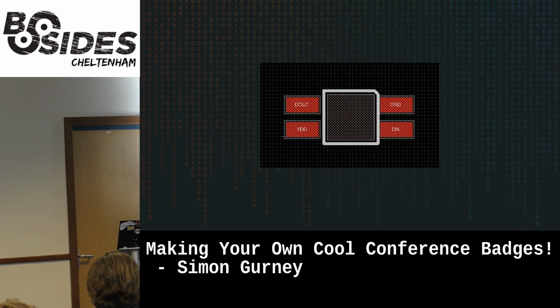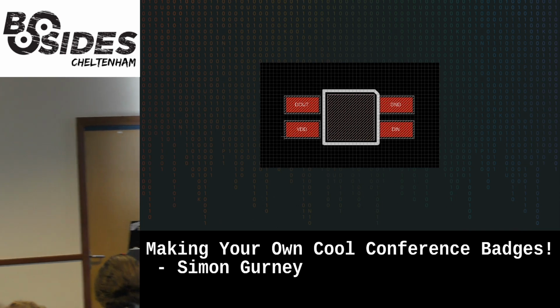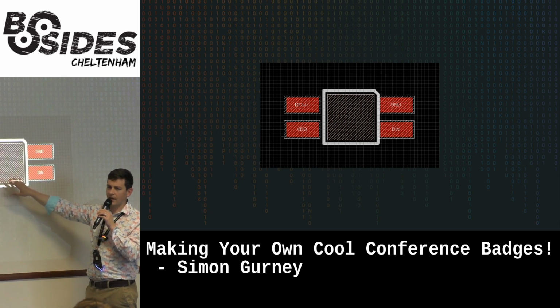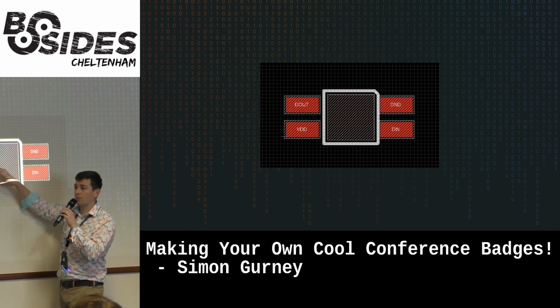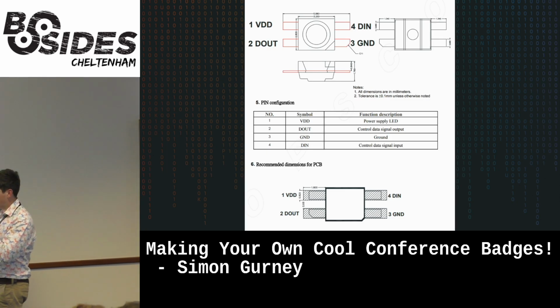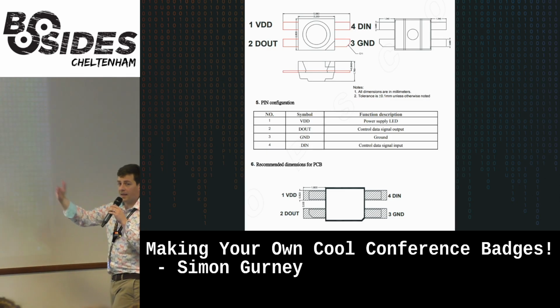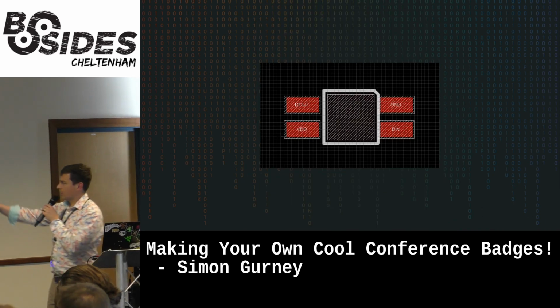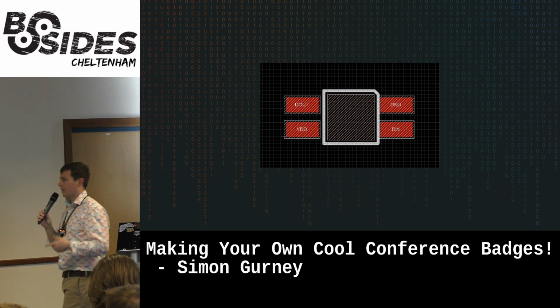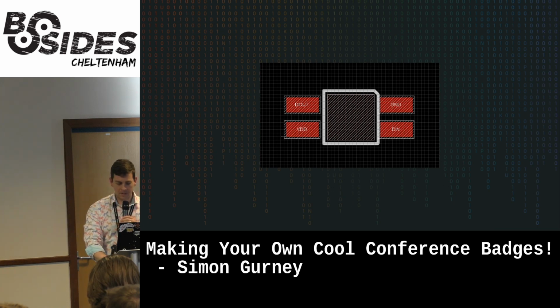This one has got a thing here. You can't really see it. The lines mean no solder mask. The red dots you can't really see are the restrict layer. So this is a reverse mount footprint for one of these LEDs. If we go back to this one, you'll see it wanted us to put the cutout here on the bottom. I want the LED flipped over to shine through the board. So the cutout's at the top. I flip the pins and I put these so that whenever I place this on the board, it will automatically prevent solder and mask going there, and therefore I can shine through the board. So let's do a quick demo and I'll show you how to do a footprint.